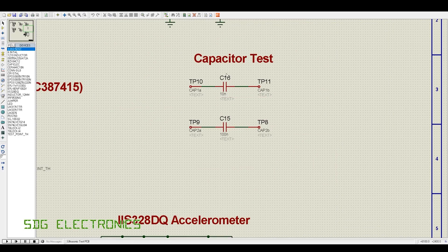I've also included a couple of ceramic capacitors. The reason I've included these is not because I think they're likely to get damaged, but they are actually microphonic. So I'm wondering whether there's any opportunity for some voltage to be induced in the circuit as a result of the capacitors being under vibration — we'll see if we can measure something with an oscilloscope. I just thought that would be an interesting thing to add in.